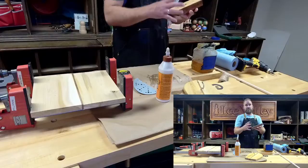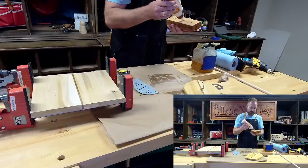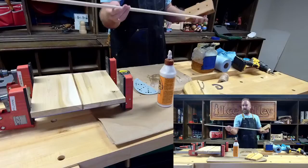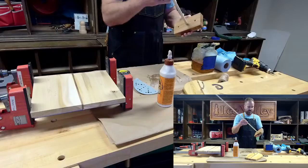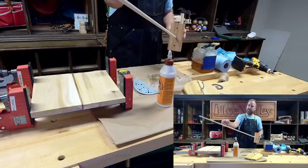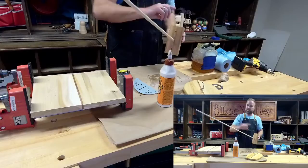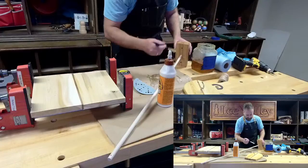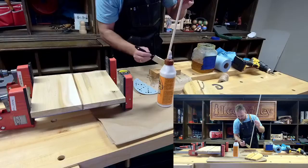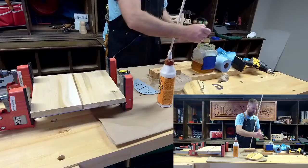The game will be mounted on the wall, so I'm going to take some glue. I've pre-drilled a hole here at 11–12 degrees into the block of wood. I have a jig at the shop that allows me to set my drill press to a specific angle. The dowel here is also from Lee Valley. That allows me to sink it into the piece of wood — the arm extends out and that's what we would use to attach the rope. I'm going to put a little bit of finish on this dowel as well, then let that dry.